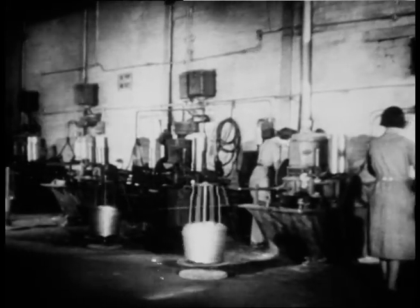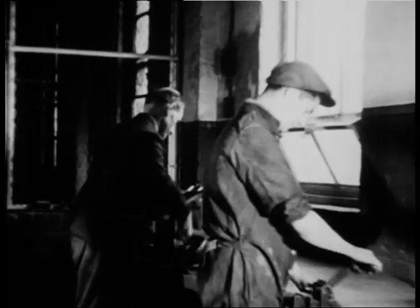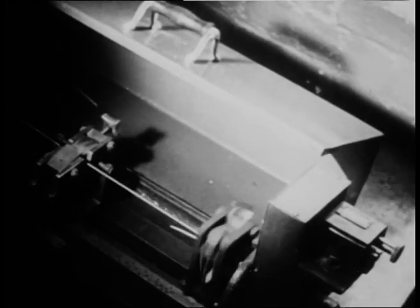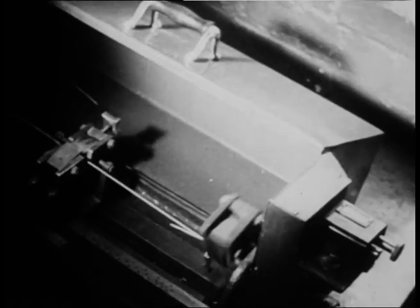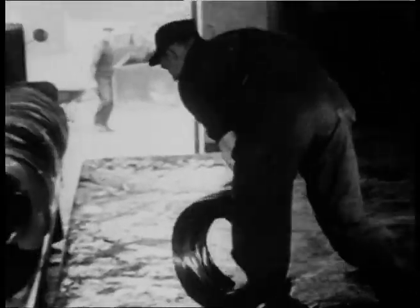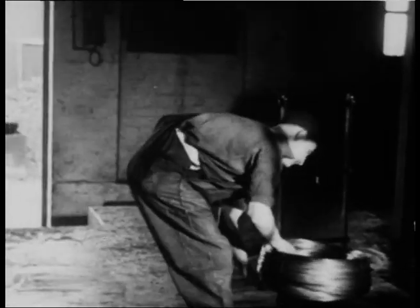And so back to the wet drawing mill, where wire is being drawn to 0.0072 of an inch. Before it leaves the mill, the wire must be tested for reliability. First you see the bend test, then a torsion test on a gauged length, 100 times the diameter of the wire, registering the number of twists of which it is capable. In addition, the two ends of all the coils of wire are tested rigidly for tensile, elongation, gauging, wrapping, and standard specification of galvanizing in the case of the galvanized wires. All wires not conforming to specifications are rejected for reprocessing.